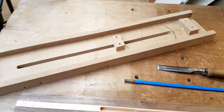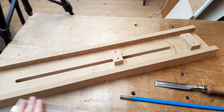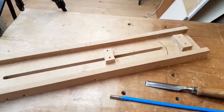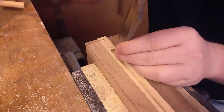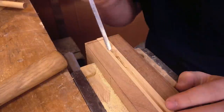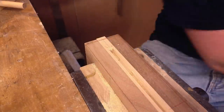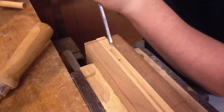I'm thinking about making another one at some stage and making it way over-engineered. Of course, the truss rod has a square end on it, whereas the router will only give me a rounded channel — so ten minutes with a chisel and it's perfect.